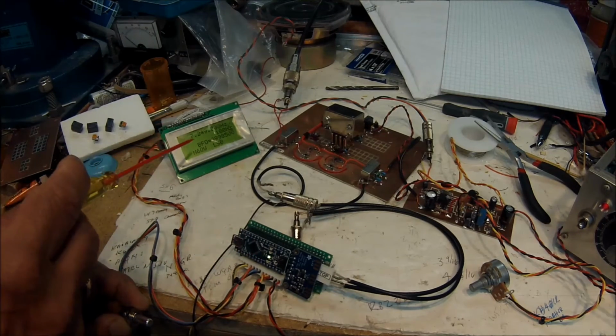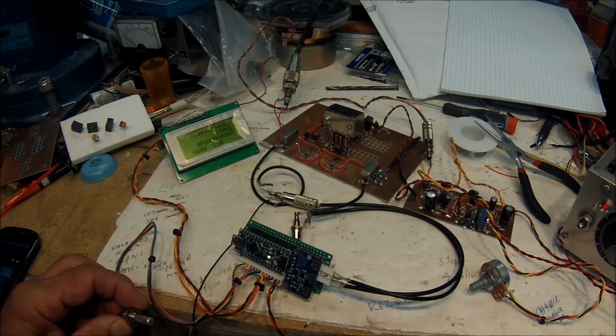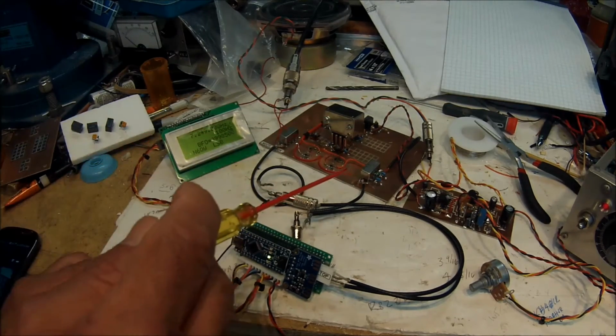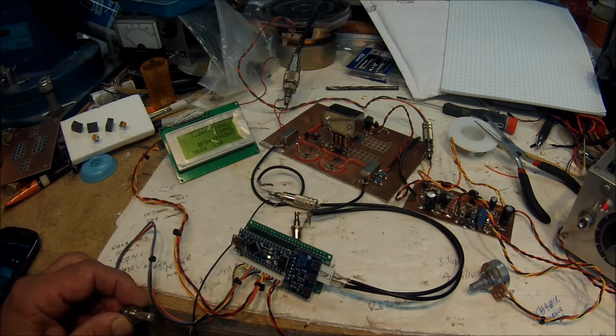And by the way, the LO as such for this receiver transmit mixer is operating above 7 megahertz, so it's at 16 megahertz, and then it dumps it down so that you go through the 9 megahertz IF. And then the Si5351 is supplying the BFO frequencies, which are tunable, by the way. And I'm going to switch to the other sideband now.